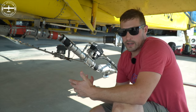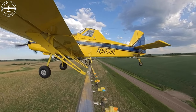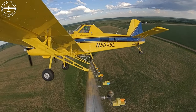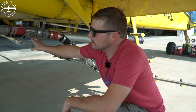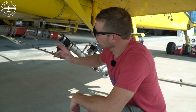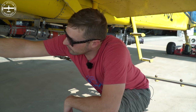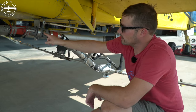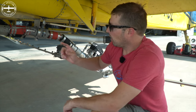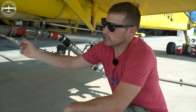It's called a suck back valve because it doesn't just turn the liquid off from going down this tube into my boom — it actually diverts the liquid. On the back side of the valve, it goes into this tube, which is where the product is loaded on the side of the airplane when I'm on the ground. The liquid goes in here, then back into my hopper, and then out of my hopper into the pump, back down to this suck back valve. So when I pull the handle up and I'm not spraying, all of that liquid is diverted, goes back into my hopper, and runs in a continuous loop.